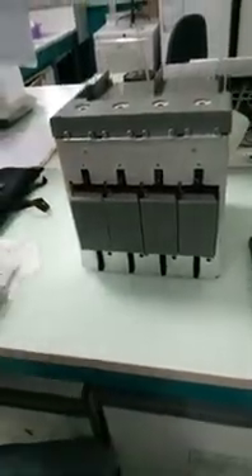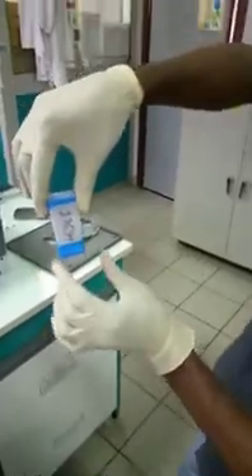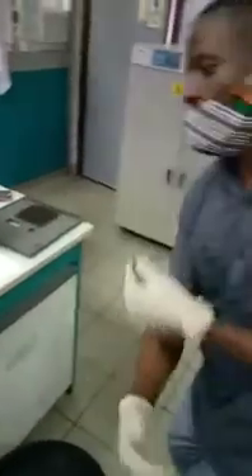Let me show you what is happening. We have this bottom part that sits on the alignment here. What happens is that the alignment, instead of getting in like this, has blocked — it went in and then it turned. Normally when it is like this, the cartridge can come out. When it turns like this, it is impossible, it is blocked. So now we need to regulate it by turning this one gently to align with the bottom part of the cartridge so it can come out.